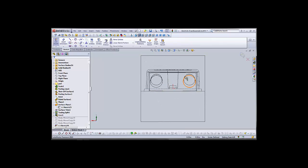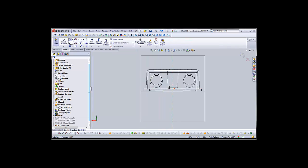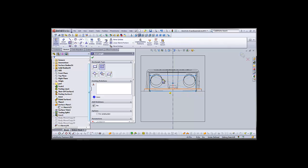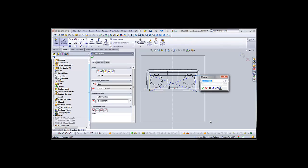We need to remember this time we're using the other two circles, the bottom two larger ones. We'll create our center line for reference and draw our rectangle again. Now, if you don't encompass the parts with which you extract completely, you'll get errors. Looks like the top part of my rectangle there is really close to those circles, if not intersecting them, so I'll smart dimension it just a slight bit bigger.